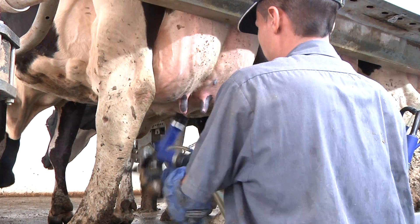I want to spend a minute on the actual mechanical steps of attaching the milking unit. It's very important that we do this consistently and that as we attach each individual teat cup, we take care to minimize air admission. We normally do that by keeping the short milk tubes bent back over the ferrules of the cluster, then raising the individual teat cups toward each teat and rapidly attaching, minimizing the amount of air sucked into the unit.